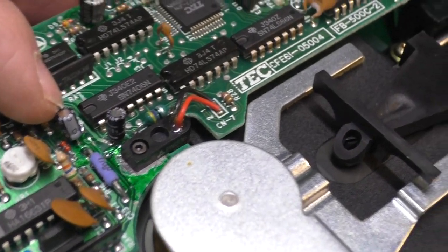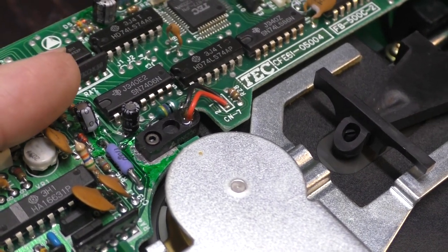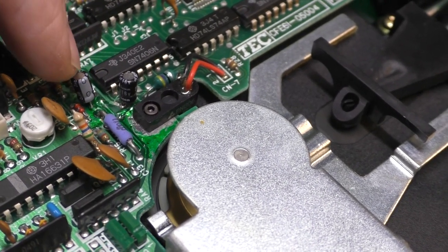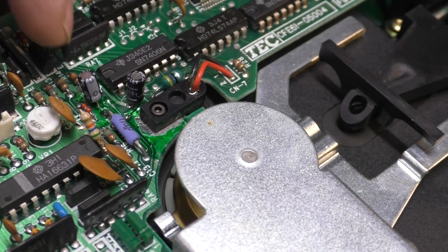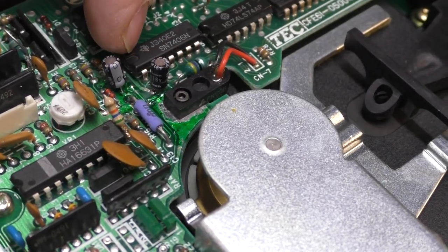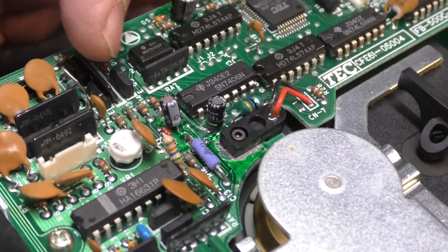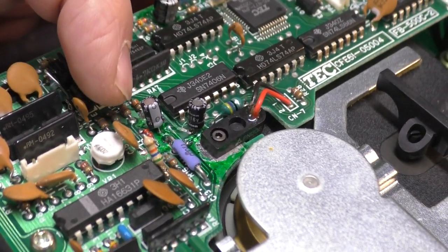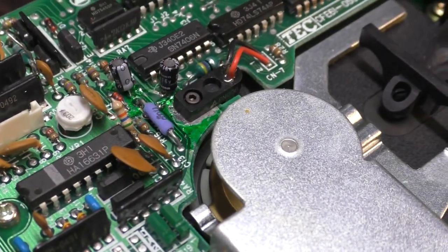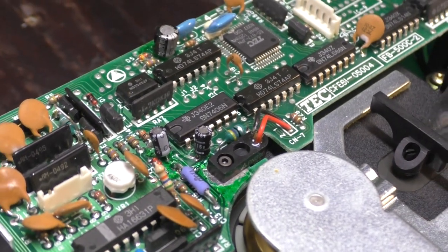And I found this capacitor here, which is C14. You notice how the stripe is pointing that way? I hit it that way. Well, this area was so obliterated under here. There's actually four pads. I think I mentioned this earlier. And the pad that was over here to the right, which I originally had the negative terminal in, actually runs down this way and it is part of the write control circuitry. So that's why we couldn't write to the disk. So I rotated this guy around, checked everything for about the 14th time. And now it is formatting disk. I can load and save and all that kind of stuff.